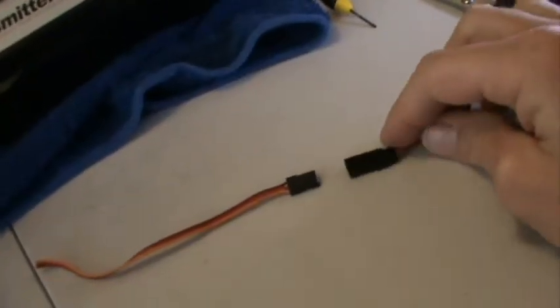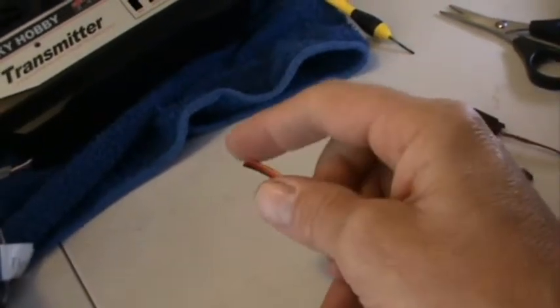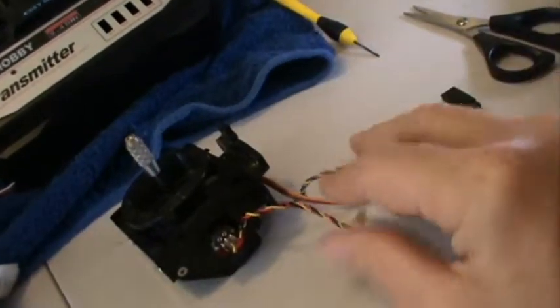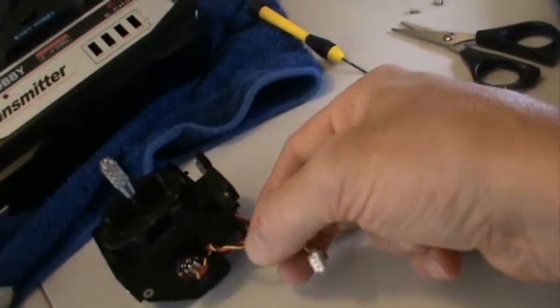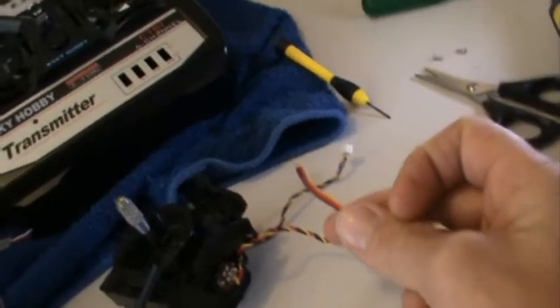Now turn the servo lead around on itself and plug it into itself, so you end up with the plug connected and bare wire on the other end. Then pull the three leads apart from each other and strip each end on both ends. On your controller, cut the lead roughly in half — whether they're going to one plug or two, it doesn't matter. Do the same: take a bit of the plastic stripping off the very end and separate the cables a little bit. Then get some heat shrink tube — you could use tape later but heat shrink is much better — cut some small lengths and thread them onto the wires.